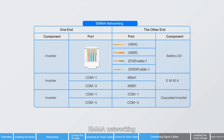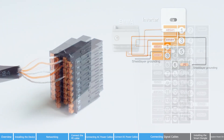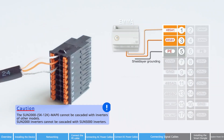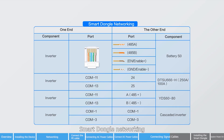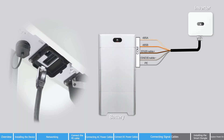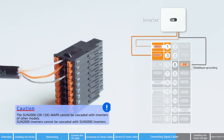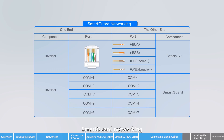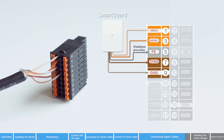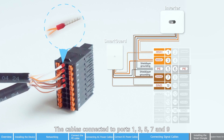Insert the signal cable connector to the EMMA. If inverters are cascaded and connected to the EMMA, the two signal cables for ports 1 and 3 need to be crimped separately. For smart dongle networking, inverters are cascaded and connected to the power meter. For smart guard networking, if inverters are cascaded and connected to the smart guard, the cables connected to ports 1, 3, 5, 7, and 9 need to be crimped separately.